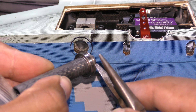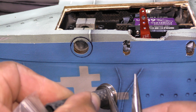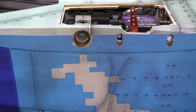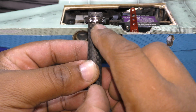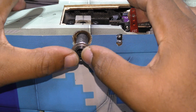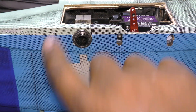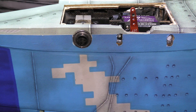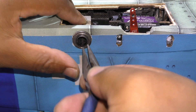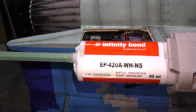We're going to rough up the edges a little bit where the epoxy is going to go. We're going to put some WD-40 or grease in there where the bearings actually sit so that nothing can stick to that. Then we'll epoxy that in place and let it sit. We've widened our hole and put grooves in using our Dremel. This is going to get glued in there perfectly so that it actually rotates. For this job we're going to be using a good epoxy.